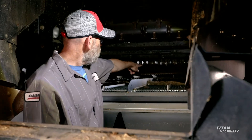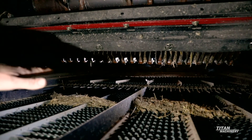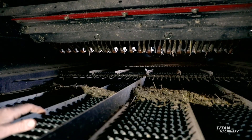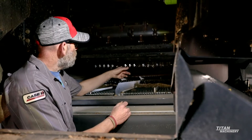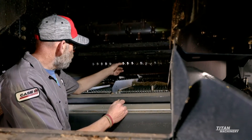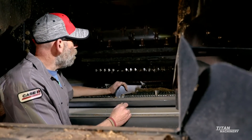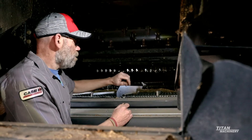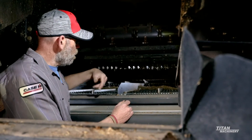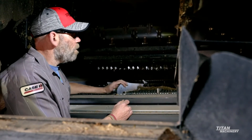Another one — you've got your pre-sieve up there. You have the linkage over on the right side here. Make sure that sieve is actually able to move up and down. A lot of times it'll start getting rust in there and the linkage rod will start sticking as it comes through and opens your sieve up. If you can't open your sieve, you have to pull your pre-sieve out, get your linkage underneath freed up, and then put it back in.